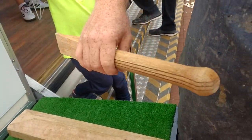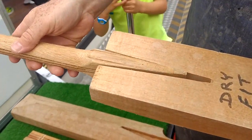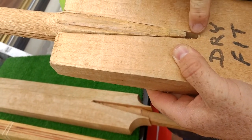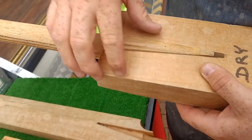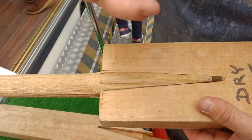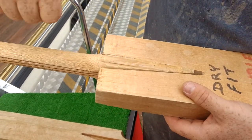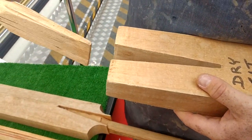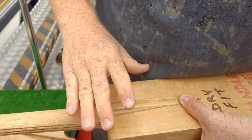The splice is then cut to fit into here. What you ideally want — when it fits in and it's been fitted flush — is that this will fit to about two or three millimetres from the bottom of the blade. Tap it in with a hammer and you should get a nice tight fit all the way around — tight enough that you can go and hit a cricket ball and it won't move. We'll then drive the handle out, hold the handle and drive the blade off. Hot glue, back in it goes, nice and flush to the bottom, and leave that overnight to dry.